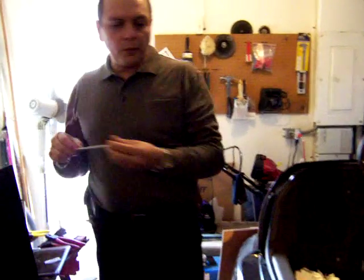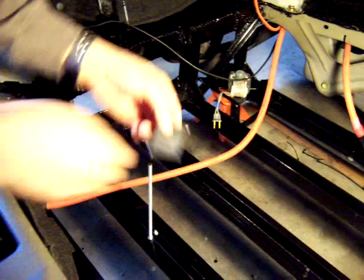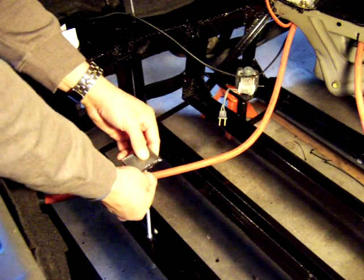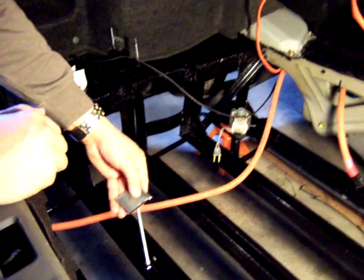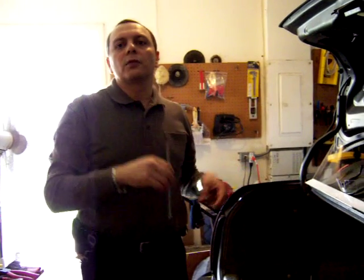I also made some holes in the battery boxes because I want to put screws between the batteries — a screw on the bottom and a screw on the top — and weld a little metal box in the center. This should hold four batteries and stop them from jumping. It's important that they don't move, because if the cables disconnect they will cause sparks and arcing, and the power consumption is so high that it can melt the battery posts and make them garbage. I have eight of these holes and six on the sides — that should be enough to keep the batteries from moving.